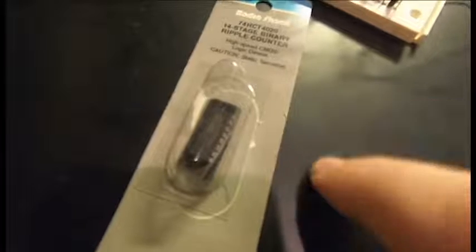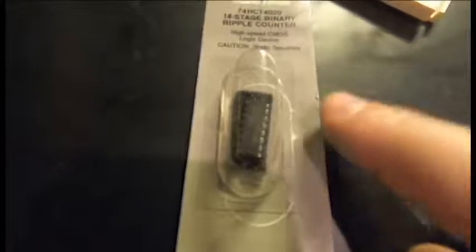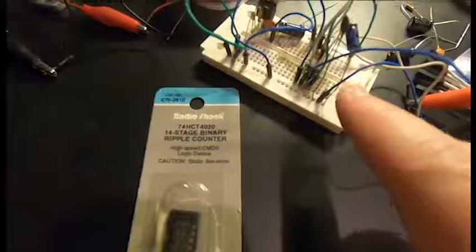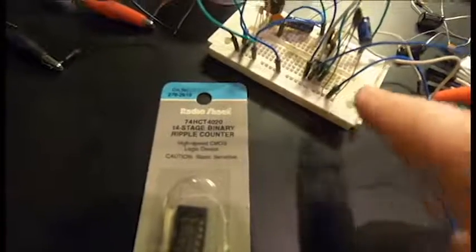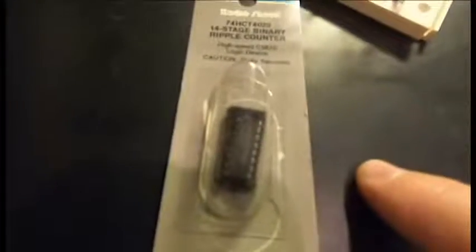That's when it would actually fire the sound, while this is going to only count up next time. So either that'll get you a backbeat, or I can just sacrifice one pin and have that be my one. There's no reason that the one of this has to be the one of this. And since this is going so fast, half of that, or even a quarter of that, will be fine. I can modify that until I find a nice bass tempo.